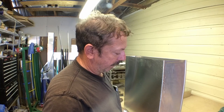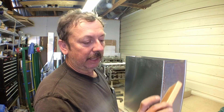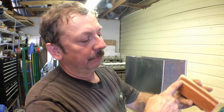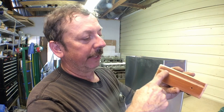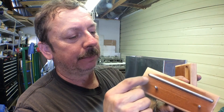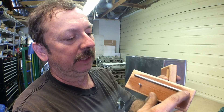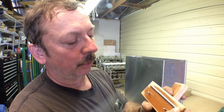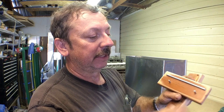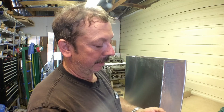I've chosen to form these this way, which anybody can do at home. I've taken a couple pieces of hardwood and routed a groove on both sides — this is probably a 3/8 groove in this one, and this has got a quarter-inch groove with a piece of quarter-inch rod in it. I've radiused both ends so it gives you a nice even radius and there's not a sharp edge that's going to form a sharp edge on your tanks. And then I've got a couple of 3/16 guide pins set an inch back — that's how far my bead will be in there.